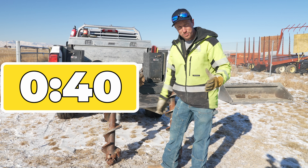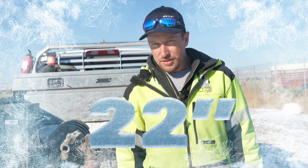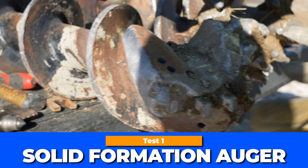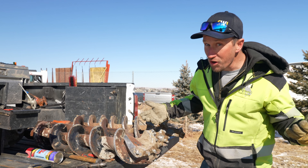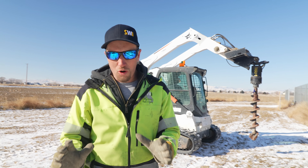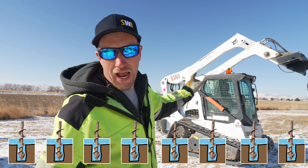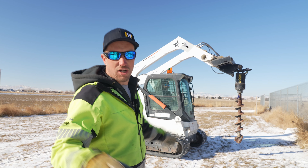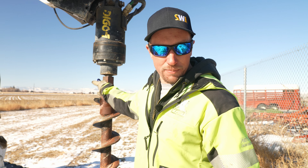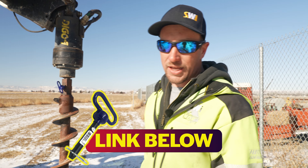All we have to do is watch the time and see what outperforms what and the best way to dig a hole in frozen ground. Our ground today is frozen — about 22 inches is what I'm guessing. So this is going to be a really good video because we have so much frost. This right here is the solid formation auger with the square teeth. The head looks totally different than the other two. This is intended for solid sandstone, maybe even some frost. Originally we were going to do four holes, but we're actually going to do eight holes because the machine has normal flow and high flow. We'll do one hole on normal flow and the other on high flow. This is the pin that we use — we like it because you can grab it easily when it's not in motion while changing it out. See the link below.